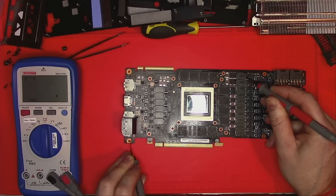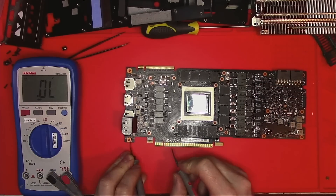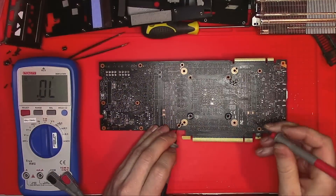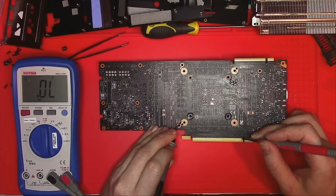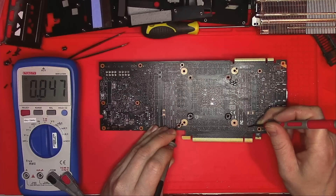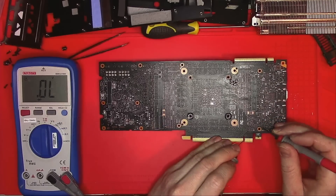Memory with 16 ohms — this is Samsung, so this is normal. While we're here, let's check the first two data output lines in diode mode. I want to see similar readings on both, and that's exactly what we have. On the back side of the board, the data input is checked after the capacitors — value there is different, but it matches one to another more or less. Same thing with clock reference plus and minus, measured at the slot, and PEX reset pin with the leads reversed.